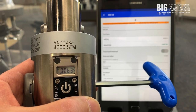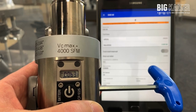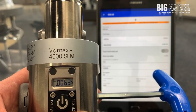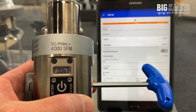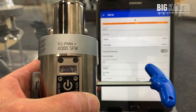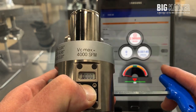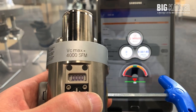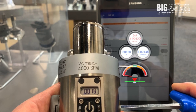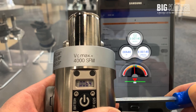That's just an incremental value of the adjustment. If we pair it with the Big Kaiser app shown here in the background on this tablet, we can input information such as target diameter and tolerance. Given that information along with the last measured cut, we can use the app to show the next output diameter of the head when an adjustment is made. As you zero out the display, the app screen switches and shows a dial gauge view as well as the output numbers for the next cut.